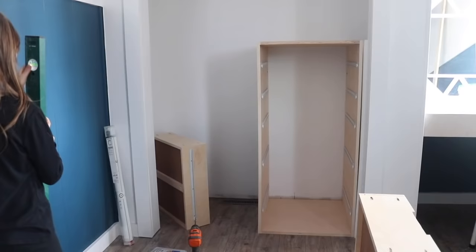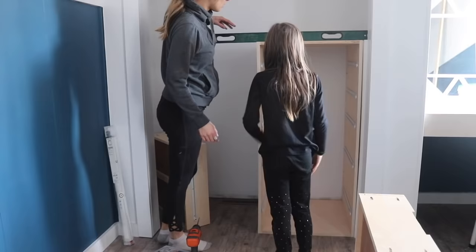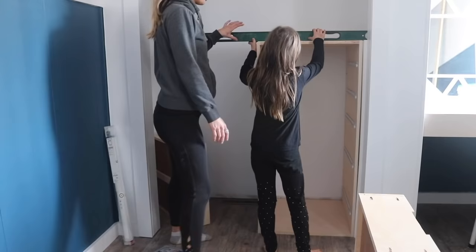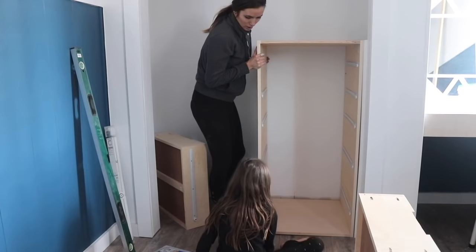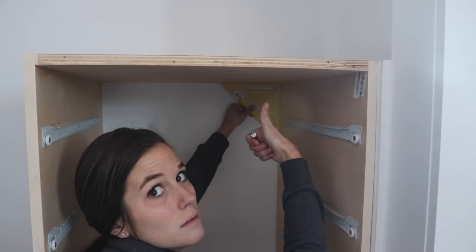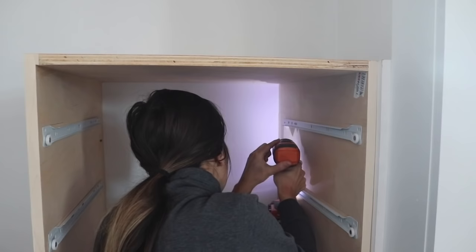The room's resident — aka my daughter — helped me install the box that's going to be for the drawers. We're using the long level to make sure it's level from side to side and front to back. The floor was not level, so I did have to shim up one side, and she helped me do that. Once we had the box lifted into place, I screwed it into the back of the wall with some hidden Kreg jig holes on the inside. Just by itself the box was not maintaining its square shape, but once it was screwed into the wall, it held just beautifully.